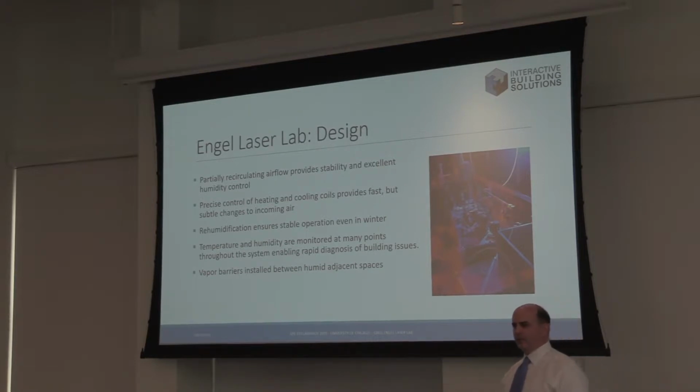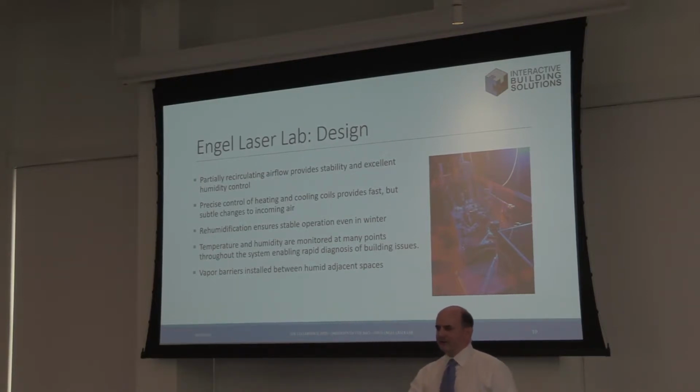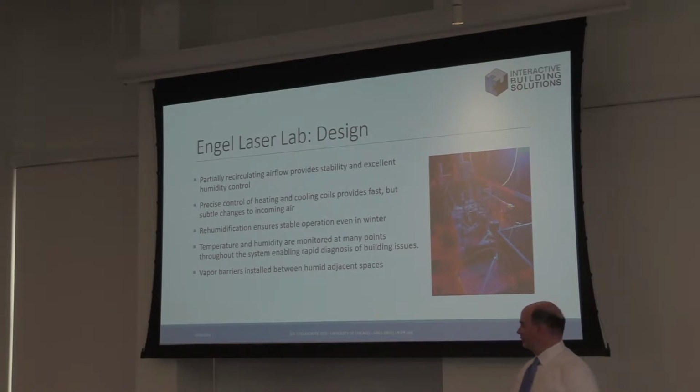This is also important. Making sure that you're watching the lab in the right place, which is typically right above the laser table. That's important. Making sure the bottom skin of the laser table is the same as the top skin of the laser table so the whole thing doesn't bend. I mean, yeah, sure, it's 3 tons of steel and it's 18 inches thick, but it doesn't take much for this thing to warp or stress or show torsional strain, and that'll also ruin your experiment. So there are a lot of these types of things where they really help.